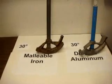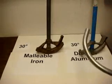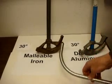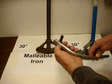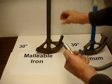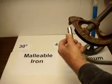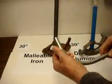There's more to be learned about bending and the various bends and stubs, but most of these benders will say for a conduit stub, subtract 5 inches. Well, if you want a 6-inch stub, you subtract 5 inches, you make a mark at the 1-inch mark, and then you put that mark at the arrow, and when you bend it, you will have a 6-inch stub.